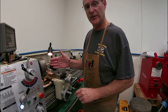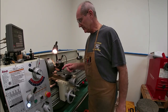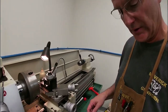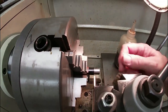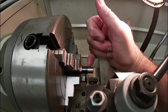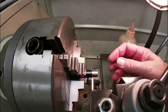We've now finished cutting the outside of the barrel to 500 thousandths. I've changed my tooling bit to a cutoff bit which will give us a relief cut. It's just a narrow blade to give us a cut so that when we are threading, our threading bit will not get pinched on the back of the shoulder. I'll show you what the relief cut is doing for us once I get the threading bit set up.